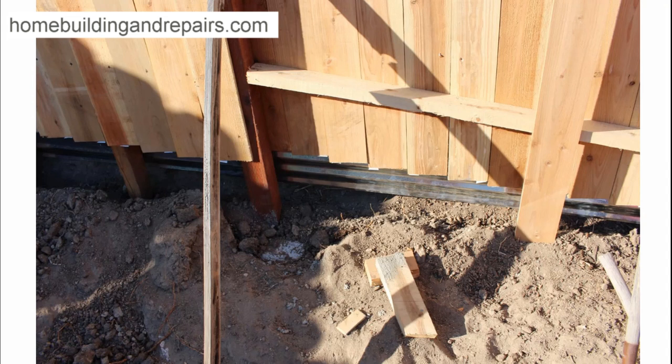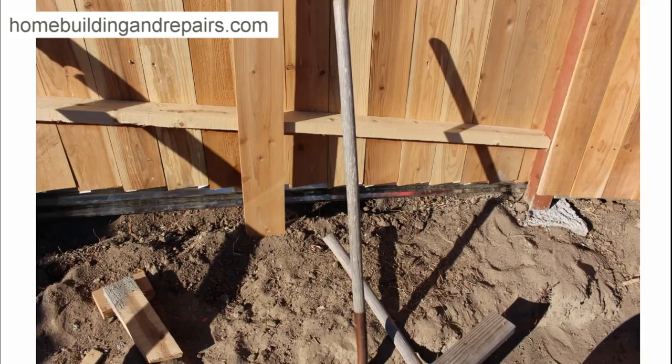The sun is going down, so coming towards the end of the day. I'm going to have to get the dirt off of here. Like I said in one of the earlier videos, I'm going to have to raise this up — because if I left this where it was and backfilled this with dirt, then this support post is going to rot faster. And this is actually a pretty important post for this section of the fence, and I don't really want to be replacing it sooner than later.